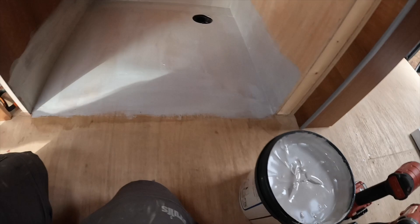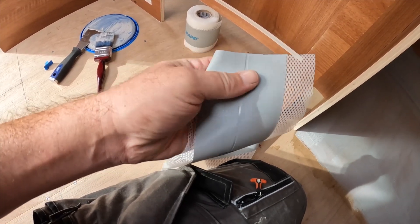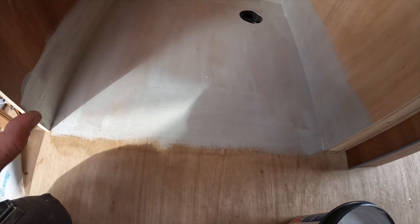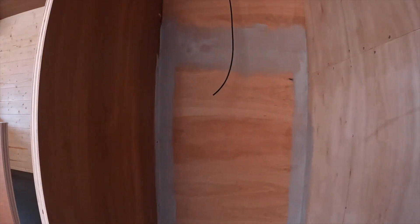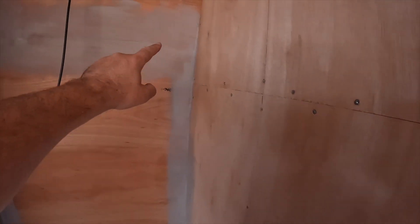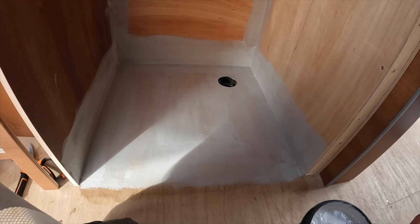The tanking kit comprises a mixture and a tape. The tape has netting on the sides and a rubber-like strip in the middle. You focus on the areas liable to leak - all the joints where there are joints in wood, all the bottom corners all the way around, the front when the front panel is on, and the vertical corners running up to the ceiling on both sides. All you do with a big brush is apply a thin coat of the mixture to start with, let that dry, then come back after a couple of hours with the tape.